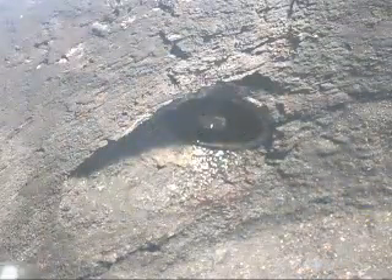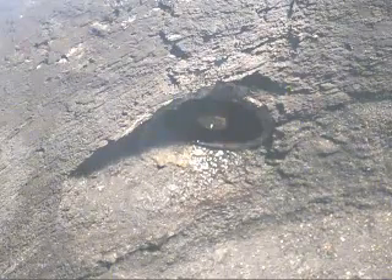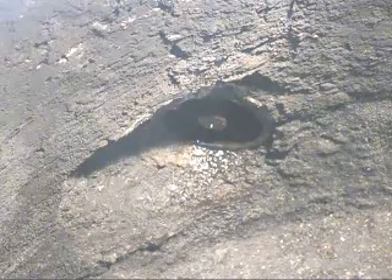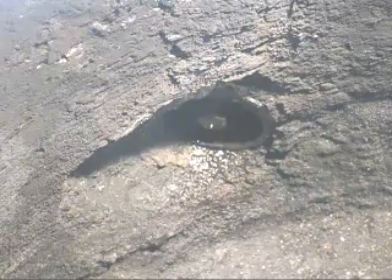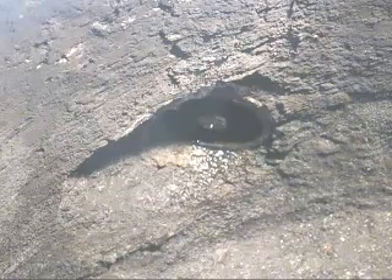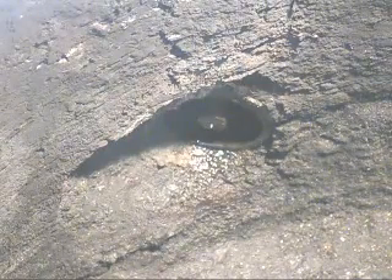I know some of you might be interested in my waste oil burner. Here is a close-up. As you can see, the outer ring is the venturi, and in the center tube you can just see the poker I use to un-carbon the jet. The jet is about 1.6 millimeters in diameter. The jets tend to carbon up occasionally.